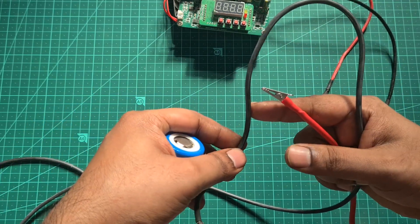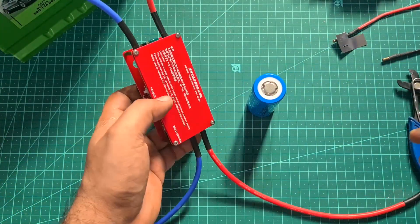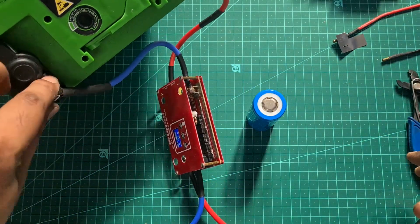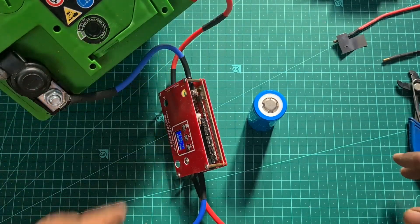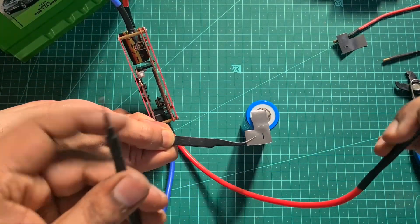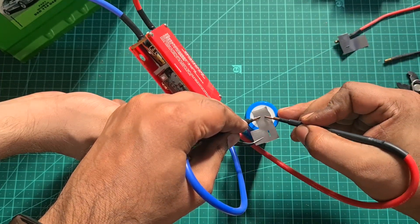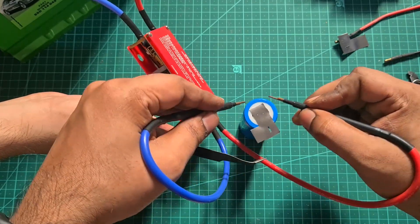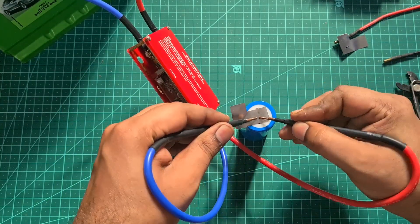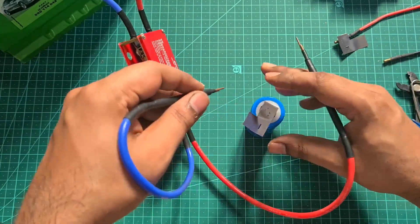So now let's quickly do a spot weld on this battery. The spot welder I'm using is one I purchased from Banggood — I did make a video about it — and I connected it to an Amaron 55H car battery with a few crimped connectors. This spot welder is quite good; the only thing is you need to make a small mod to it, but it works like a charm once you do that. I'll leave a link in the description. Make sure when you buy a spot welder you use a good quality battery — either a lithium polymer battery or a car battery that has high discharge current.